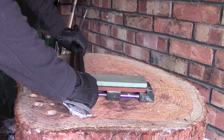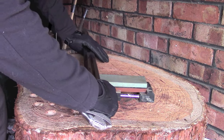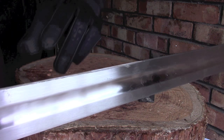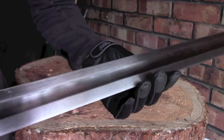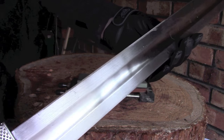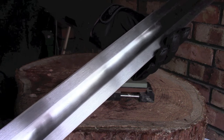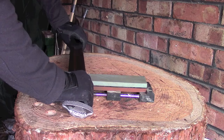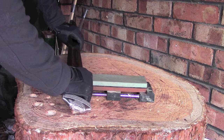Hold one particular section of the blade and put it onto your stone exactly the same way you would when sharpening a knife or an axe — find that bevel point and run your blade across the stone. You can see the discoloration at the top edge where the slurry from the stone is leaving a line, and that line is what will become my edge. I'm just going to spend a little bit of time working on this part of the edge, and then we'll cut back and I'll show you how I'm getting on.